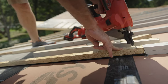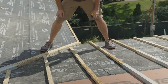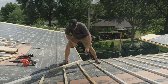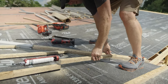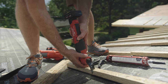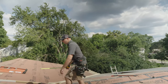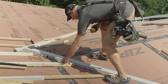The other thing I need to do: the guys messed up a little bit here and used the vented section on top of here, which will make it too thick. It won't plane out because the three-eighths-thick corrugated plastic that is the old-style UV batten is now sitting on top of our three-quarter-thick. So I need to cut here and replace it with inch-and-an-eighth, and same here — inch-and-an-eighth — just like these are all the way across the rest of the soffit. We also have some areas that aren't going to vent as well, right up here at the very top. We're using material where we can, leaving gaps to let a little bit of air up here, but I'd like a bigger gap there — it's not going to harm the sheathing — so I'm going to cut this here as well.